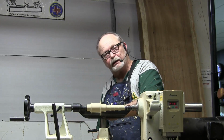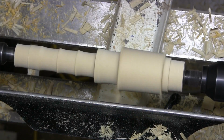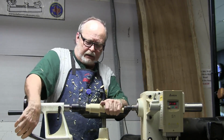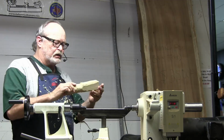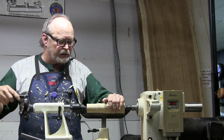And the handle's straight. A minor cut, but it's still helpful. It's a helpful cut to move wood away. It's one of the reasons I don't like the oval skew. You can't virtually do that cut with an oval skew. So roughing with a skew, planing, and peeling. Now, when I first started, this was the only cut really described, was the true planing cut. A lot of the cuts with a skew are finishing cuts, and I'll show you why.